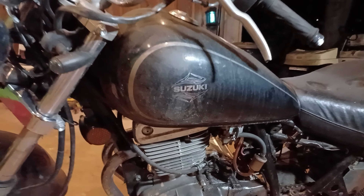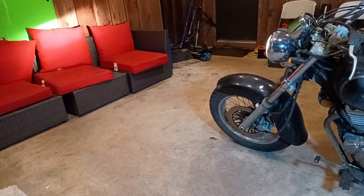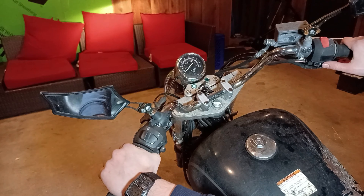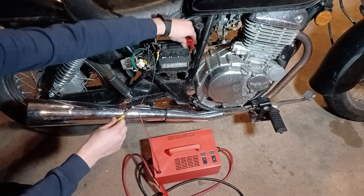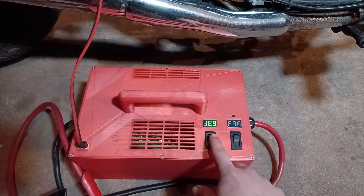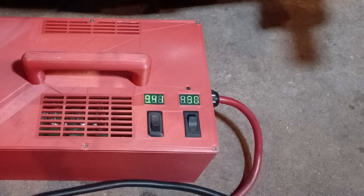Now that the build is complete we can go ahead and test it out, starting with a Suzuki GZ250 motorcycle. In order to test it we'll turn on the headlights for about 15 minutes, which will drain the battery to the point that it can't start the engine. Then we'll hook up the input from the jump starter onto the battery leads of the motorcycle and flip the switch, which will activate the super cap charger to slowly transfer the charge from the motorcycle's battery onto the jump starter.